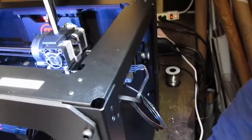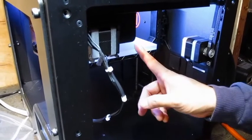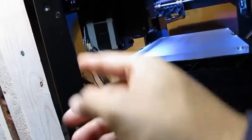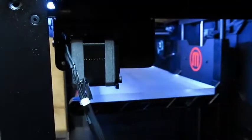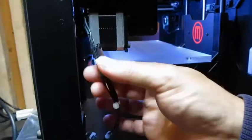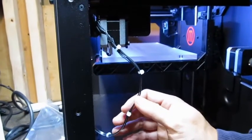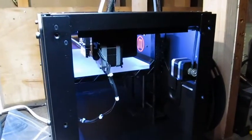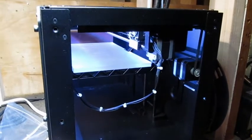Now we're going to go ahead and go to the y-axis and just see how these wires are going to flex and make sure we've got enough room. That's all the way back. We put the build plate back in just to see how close these wires are going to come to it. The wires used to go through this metal clip back here and through a cable tie hole, then came down and did a zig-zag across here. The damaged ribbon cable is here and here where it made the sharp radius. So I ordered some replacement cable harnesses from MakerBot, but we actually need to print something the next couple days, so I'm just going to leave this loose like this to see how that goes. It seems like it should be just fine.